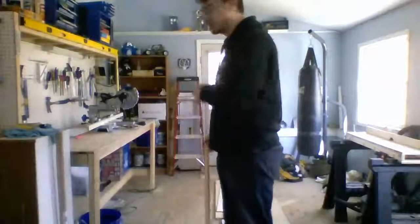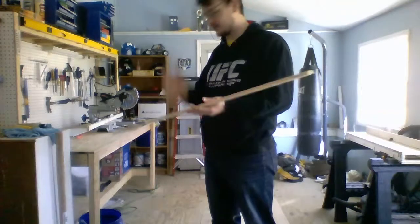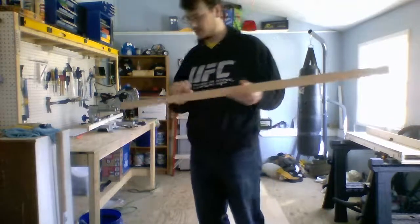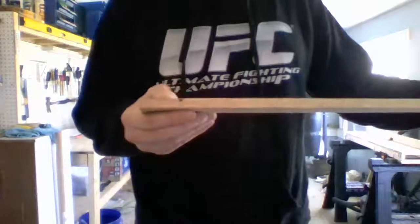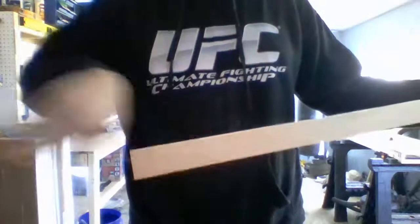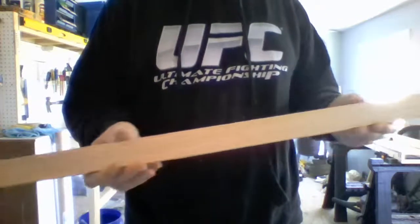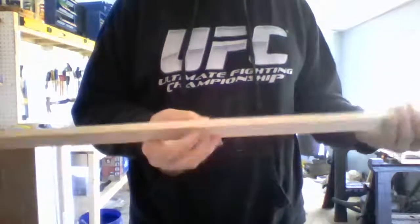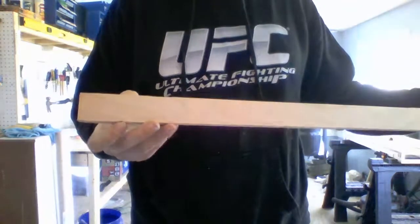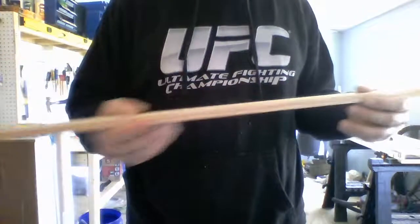I will then come back over here to my miter saw and again set the stop block so I can make 2 11-inch pieces. Then I'll remove the stop block and do 2 3.5-inch pieces, and those will be the 4 walls. I'm noticing, obviously with this being a piece of plywood, there are some spots here that have some voids in them. So I'll need to probably avoid these chunks. I'll probably just slice this off and not use that end. If they're only in one side, like this one, there's not a corresponding void on the other side. So this can just be the bottom. But this particular void on this end is actually all the way through that layer of the plywood. So this piece I'll probably chop off and not use. Yeah, we'll kind of go from there.